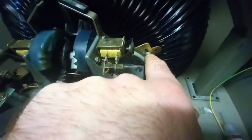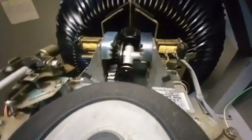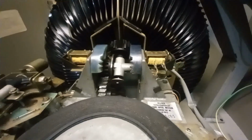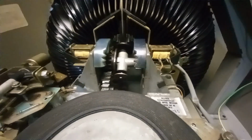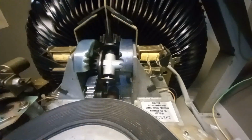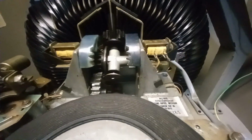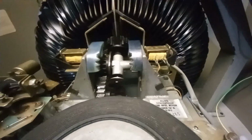I've adjusted that so many times according to all the YouTube videos that show you how to do it. So I appreciate people might be commenting saying yes, you can do it like this, move the sensor to the carousel's at 99 and all that. I have done all that so many times. I've had the sensor tested, that was fine. The sprag wheel's fine. The bushings on the sprag wheel are fine as well.